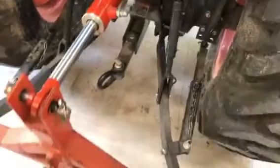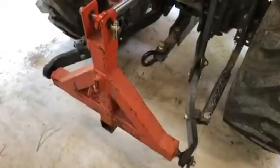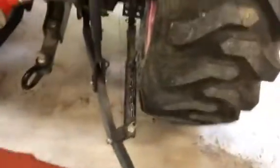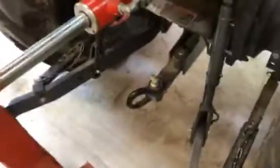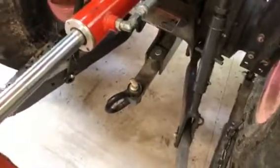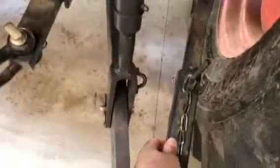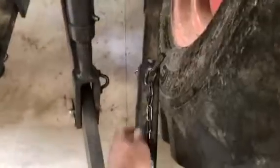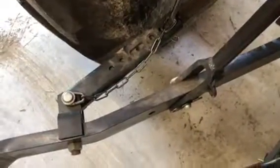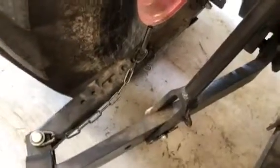You can see in this case I've just got a simple three-point trailer hitch mounted on here. I'm going to push this over to one side, and you can see it's stopped that sway — it's checked that sway by putting this stabilizer link in tension. It's tight. If we come over to the other side, this one is loose. That link has not gone into compression; it's just kind of dangling there loose, and that's the way you want it to happen.